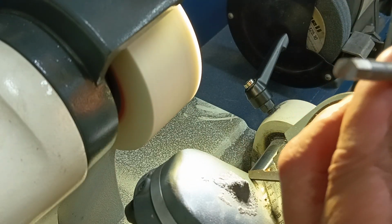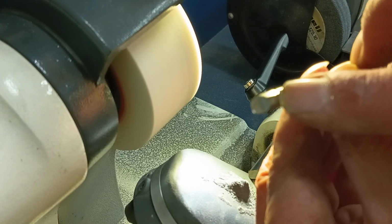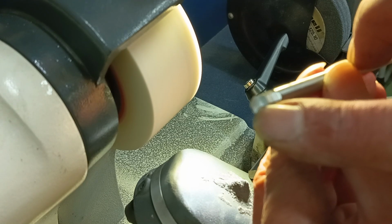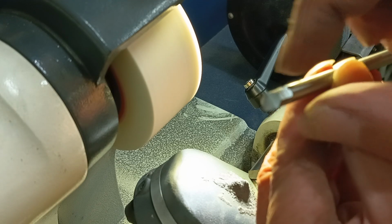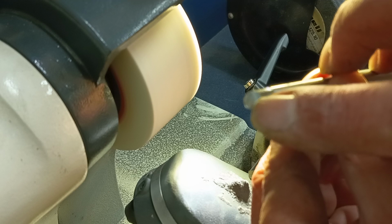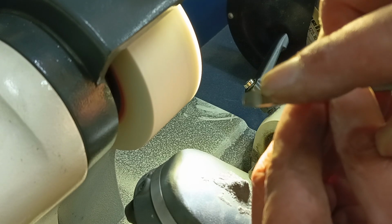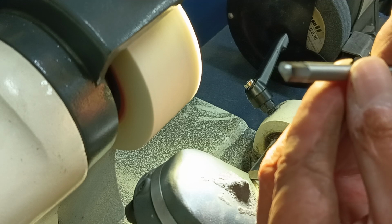And there's my cutter, a Hexagon D bit with a 1.5mm radius on the front of it and a 6mm diameter. And of course I only had to take that flat part way up, not all the way, because these facets will cut a little bit. And that's a Hexagon D bit.